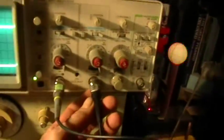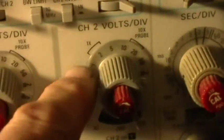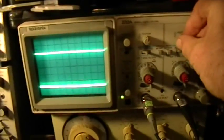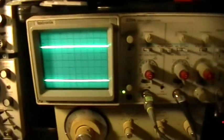the center conductor here, and this is going to channel 2 of the oscilloscope. There's no attenuation in this probe, so that one's going to be read at 2 volts per division, okay, on channel 2, which is that channel right there, and that's where its baseline is going to be, okay? And on channel 1,